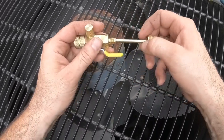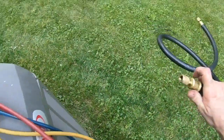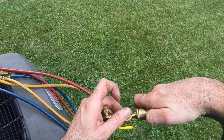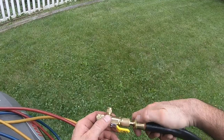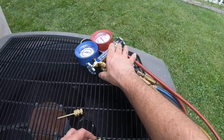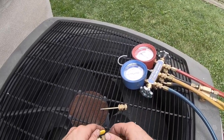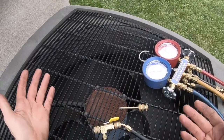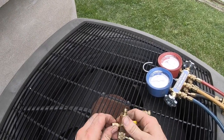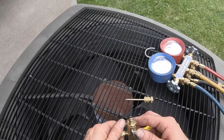Besides being able to pull Schrader pins out of AC units, you can also, once the pin's out, connect onto a bigger vacuum hose and just pull the vacuum. Without the pin in the way, you'll get a much faster vacuum pulled on your refrigeration system. The same also goes for hooking your regular hoses right up for charging, pressure testing, or vacuuming. There's even another port on this side so when your valve is shut, you can still access your system right on the other side of the ball valve, which comes in handy.